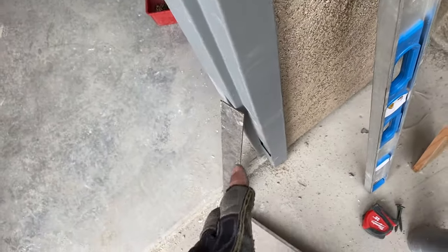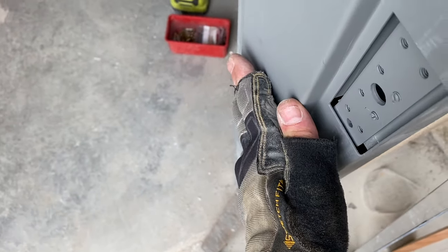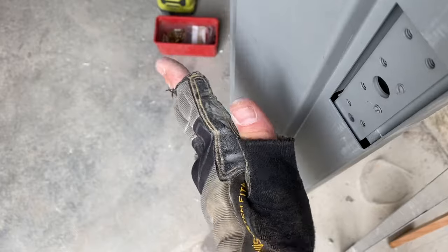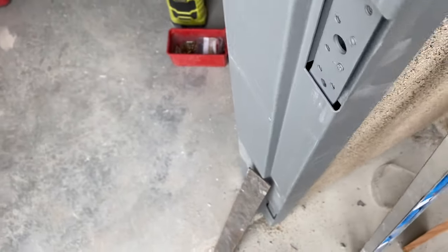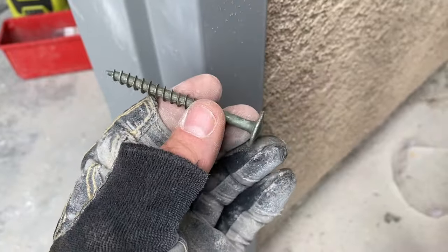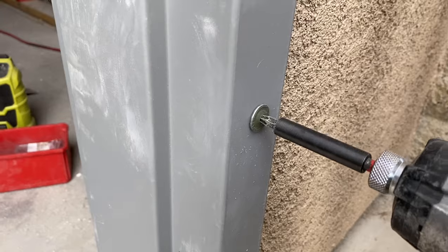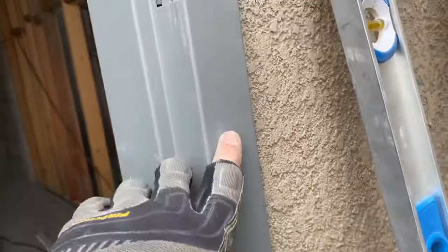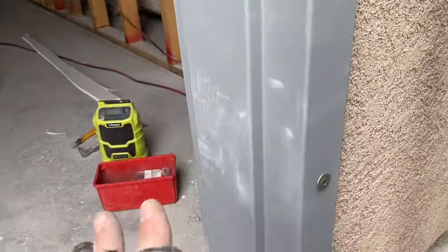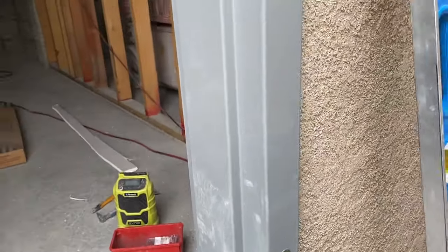So now I'm going to drill a hole on each side. You also have to visually check and make sure the jamb is not twisting one way or the other. With my hole drilled, I use these 3-inch exterior-grade washer-head lag screws — these work great. I'll put in another one and one on the inside, but that's all I want to do for now. Now I want to hang the door and test it, because if I have to take it apart — and sometimes that happens — I don't want to have put everything in place.